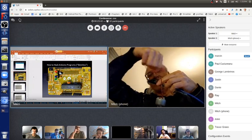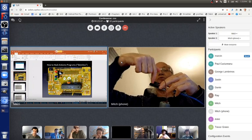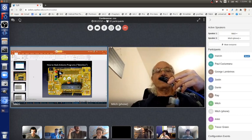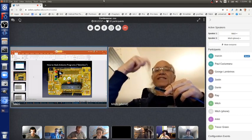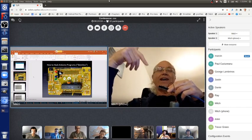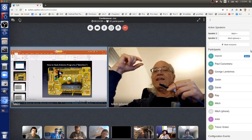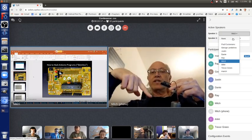If I hook it in the other way around, black to pin 13 and red to ground, it'll spin the opposite direction. That's what DC motors do. So this is another hardware hack of our Hello World program. Now imagine hacking the blinking program again just a little bit. Instead of one output pin, I have two. And each one goes to a motor,